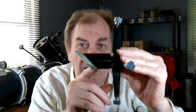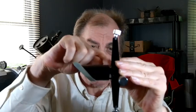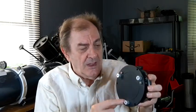If you look close, you can see the screws come down through the assembly into a piece that moves around. There are two sets of screws in the back: these are the lockdown screws, and these are the collimation screws. Use the collimation screws — loosening or tightening them — to move the angle of the mirror. Then use the lockdown screws to lock it in place once you've got it facing the way you want.